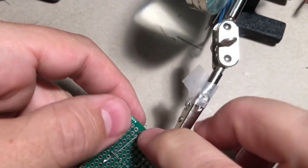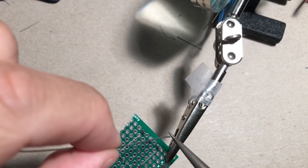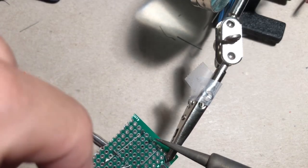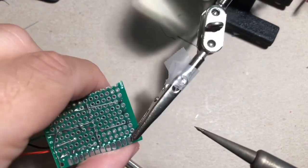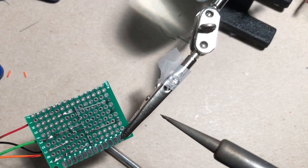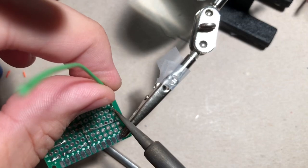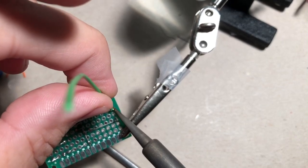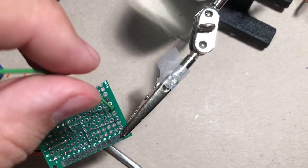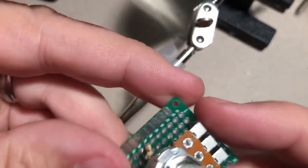we'll just put a little bit of solder on that leg just to start with. All right. Get a little bit of a blob going, nothing too wild though, okay? It's in place, so we're good to go. And then we'll just grab a wire and solder that directly to the leg, okay? And that's our output wire. So this thing is actually fully wired up.